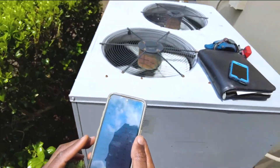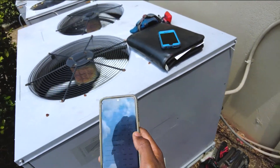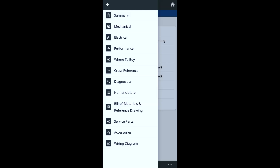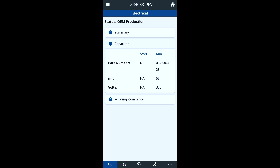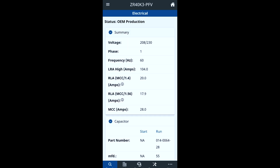It's really cool to be able to see if you're getting the proper temperatures, volts, amps, and pressures that you should be getting from the manufacturer. I pulled this up off of an older system — I wasn't able to capture it with this system because it's three-phase, but this is an older single-phase system. You can actually pull up your electrical data and find your capacitor size — so if you've got a single-phase PSC motor and you've come across problematic capacitors that are completely worn with no proper specs on them, this app will show you the capacitor size. That's a pretty cool feature.